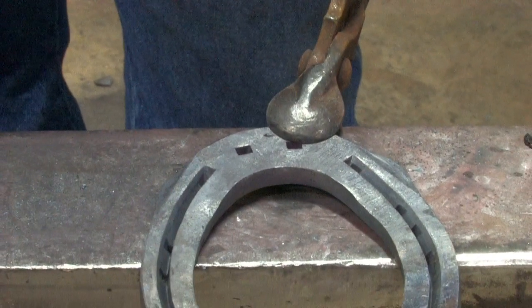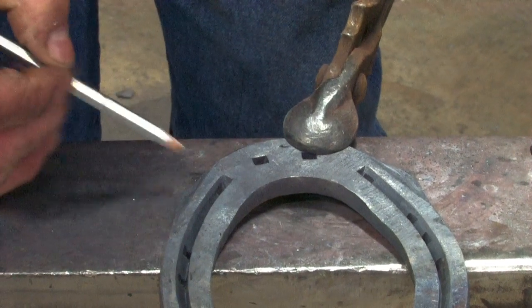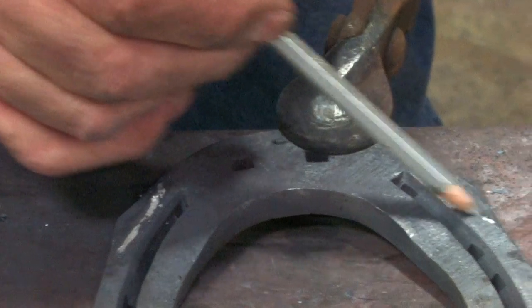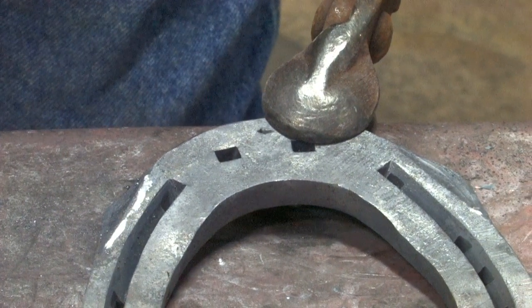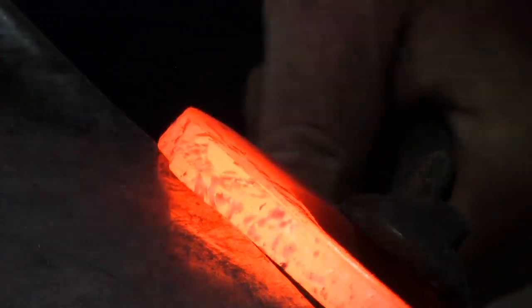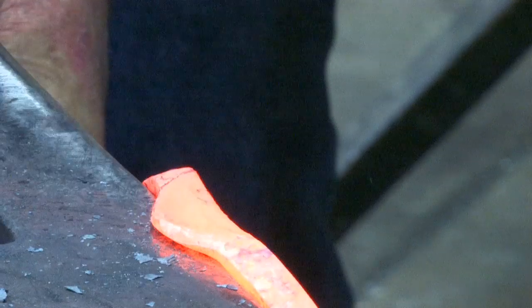Now when I clip an Italian shoe, they like big clips. If you see in the picture, even though they've made Masselots, they still come in with their hammer and take a little bit more material. So it's not that you have to leave a square edge with Italian shoes — it's very important that they have large, tall clips. I'll start taking some material out of the shoe to get my clip big enough. Once I've got the material brought back, now I can start drawing the clip. It's very important to bring it from the base so the clip gets tall enough.